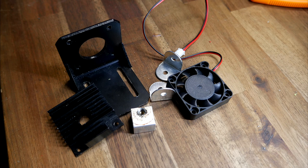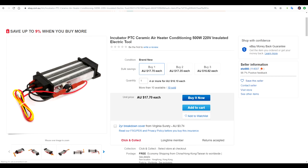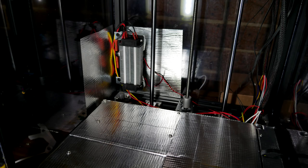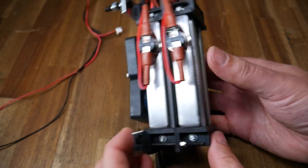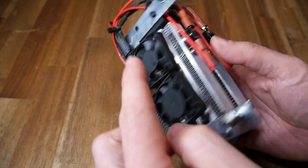In the previous video I was using a heater cartridge on a heat sink with a fan to try and heat the chamber, but it was massively underpowered. A gentleman named Rod in the comments pointed me towards a PTC self-regulating heater. I found some cheap ones on eBay and they came pretty quickly. I added insulation tape to all of my printed electronics enclosure as well as to the acrylic panels either side of the heater. Despite being mains powered, the output of the heater was still underwhelming, but Rod was in touch via email giving me some much appreciated pointers on how to refine the setup.